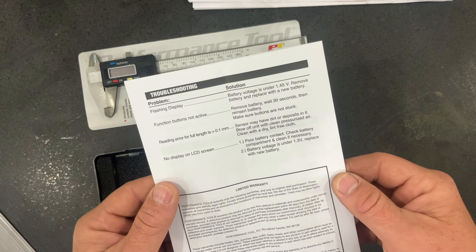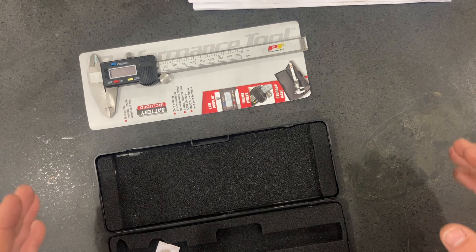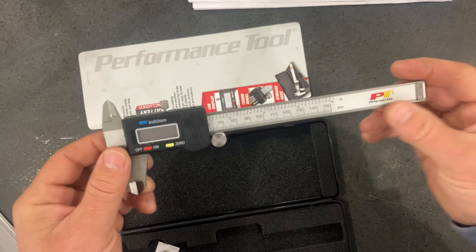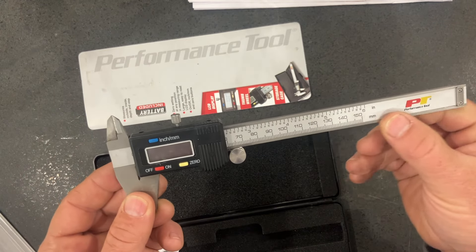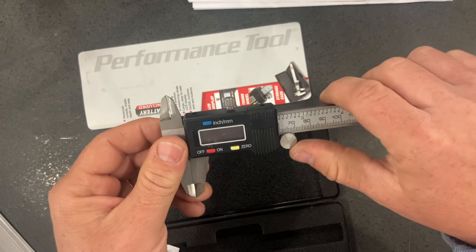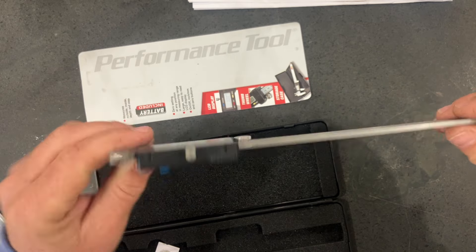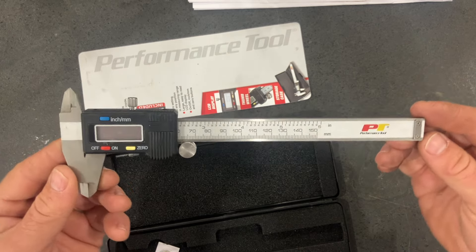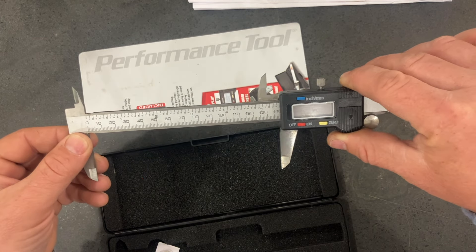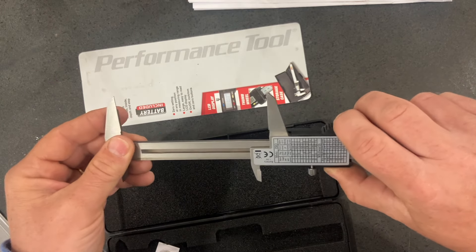Is it worth it? What if you're just a home hobby guy on a budget and you've just bought your first Atlas lathe or something? Can you get by with this until you get a better caliper? My first impression is that the fit and finish of this is absolutely terrible. Just holding it in my hand, it feels rough — it doesn't have a good surface finish. It doesn't look bad on video, but it feels very, very cheap compared to my Starrett dial caliper or my Brown & Sharpe made-in-Switzerland dial calipers. It just feels cheap, which is kind of expected for $32 at O'Reilly Auto Parts. It drags horribly — this thing has the worst fit and finish I've ever seen on any caliper. But maybe if I put just a drop of oil...